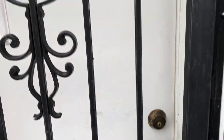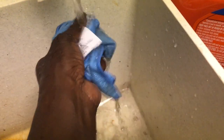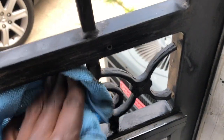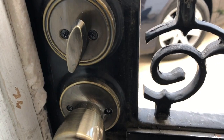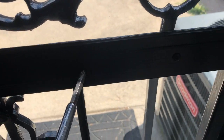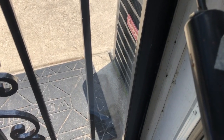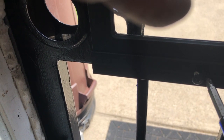Here we have my door — I'm kind of embarrassed it should have been done a long time ago, looking bad. First mission is to wipe down the door from all debris or dirt. I took off the hardware, the knobs and the locks, and the hardware includes taking off the windows to this door, which involved just a couple screws. I also took off the return, and that leaves the door free so I can get the paint into all the areas, even the smallest areas.